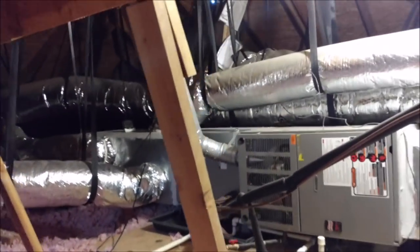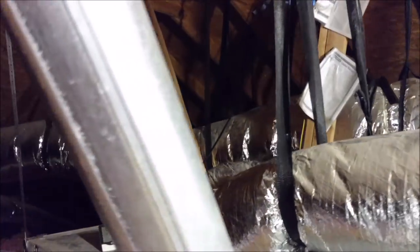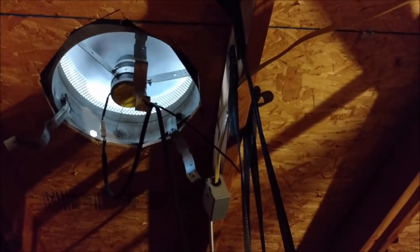Right there. I'm doing this in the morning because it still gets hot up there, but much much cooler with this thing running. I think that's what the problem was with my home — my central air, as you can see right there, is a backup to my window shaker solar-powered units. But this thing really wasn't even running, so it wasn't evacuating all the trapped air because that solar panel or the wiring up there was messed up. So I just spliced it into the DC fan there, and as you can see it's chugging along pretty good.